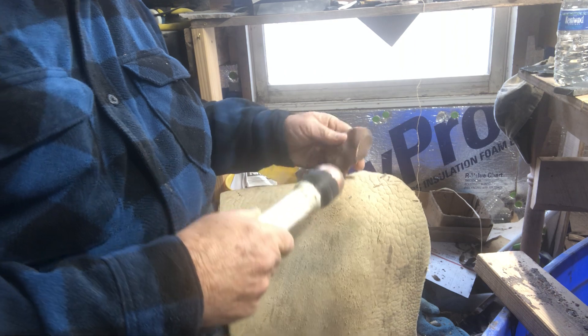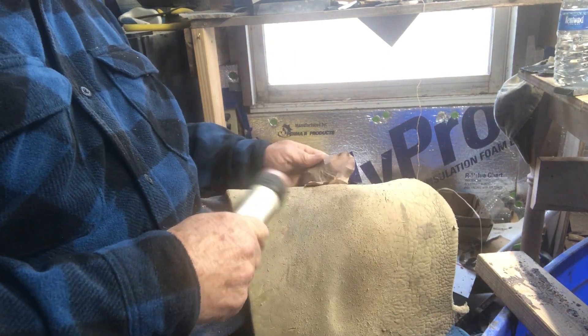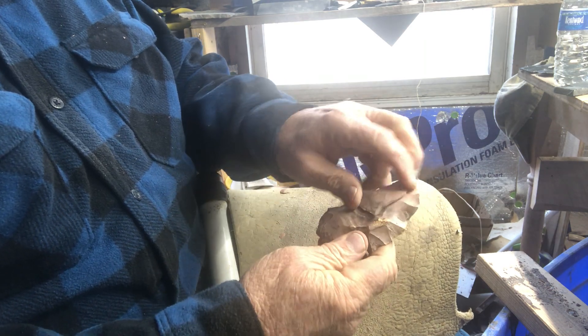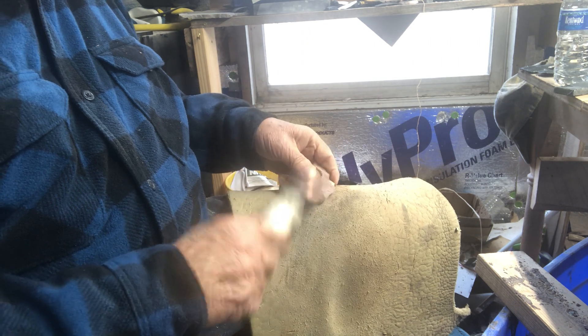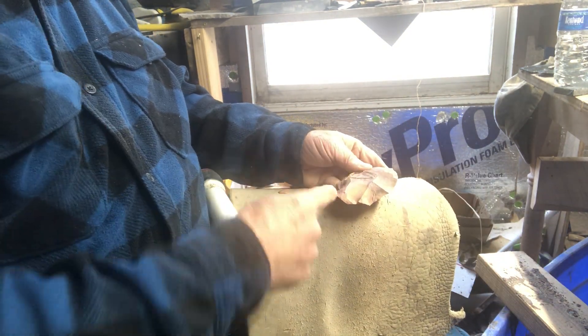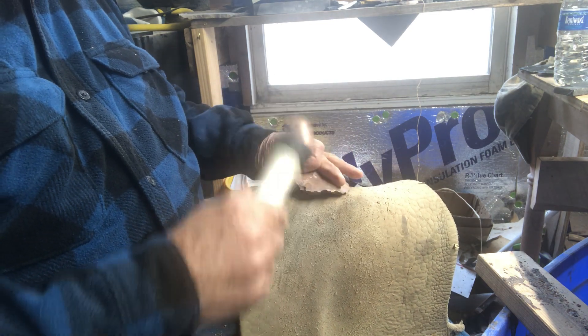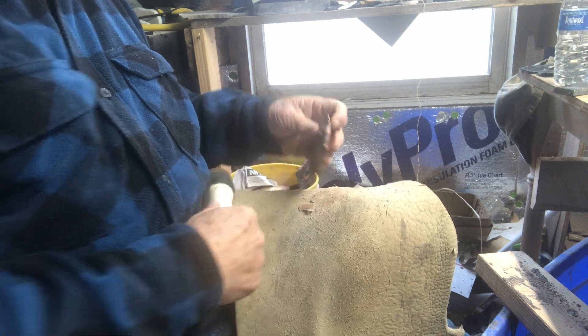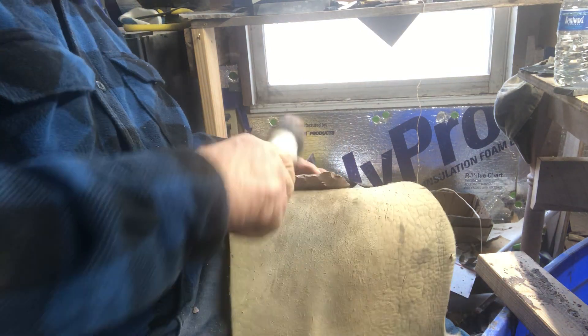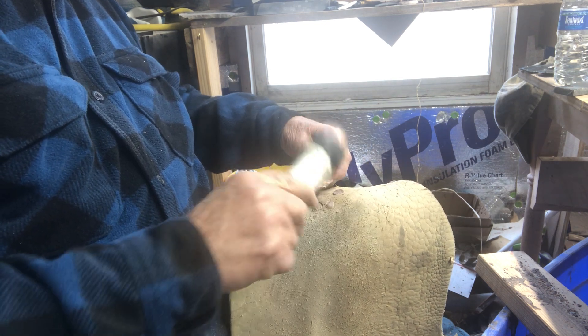Now I've got some solid stuff up here to hit on and get the rest of it out. I'm going to get rid of that billet — it's heavier than I like to hit with. I like short handles; I've got to cut the handles off those others. I was learning how to make them and didn't realize I didn't like long handles. I like them about this weight. Come this way — it took a lot of that high spot out. Now I'm going to come this way off the side. I could have made a fluting plate to come straight down, but I'm going to make them go across like this — look how good that works. I'm going to take a little off; I'm not grinding — I just want to move a little bit. Get some more of that rotten tooth, got to get that old bad cavity out of there.